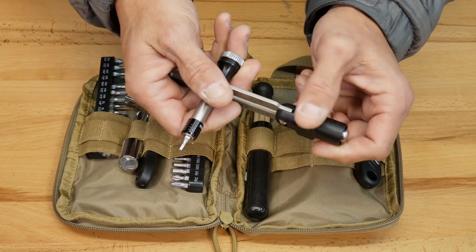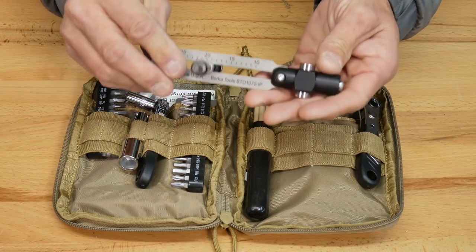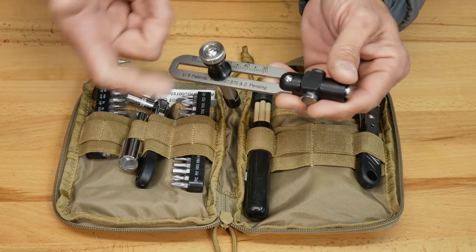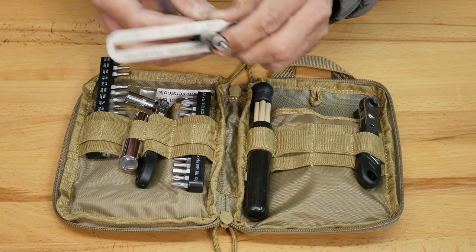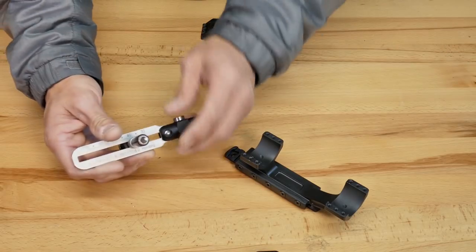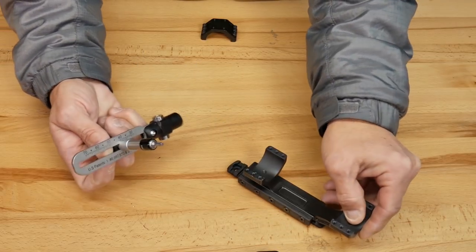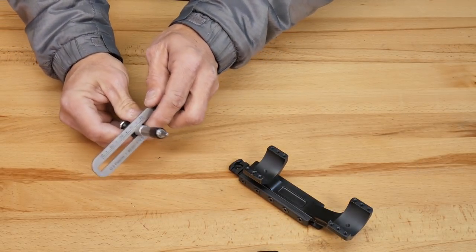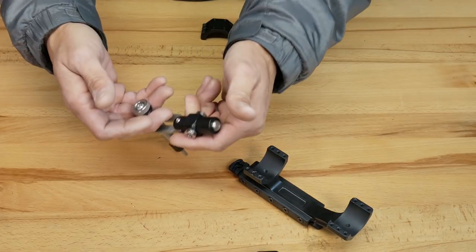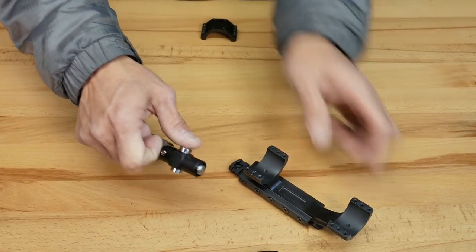Depending on where this is on the scale, it determines how you're going to have to hold it. You're either going to hold it between certain fingers depending on how close it is. This is kind of in the middle, so I'll place it between my middle finger and ring finger. I'll grasp it like this, and now my thumb will go on this plunger. As I start to torque, when I hear the click, I know that I've reached that value. You just reset it and then go to the next fastener. For demonstration purposes, the JP cantilever mount calls for 39 inch pounds on the side clamps. So what we do is slide this to 39 exactly, do my quarter turn. Based on my hand position, I'll clamp it here for a perfect throw with my thumb on the side. This is a T20 — I'm just going to turn this until I hit that click, and then reset to the middle.